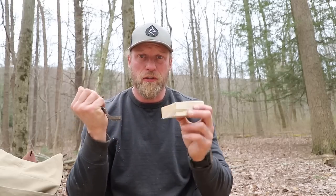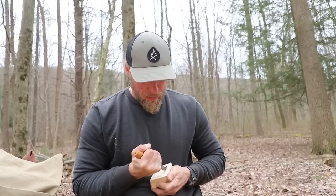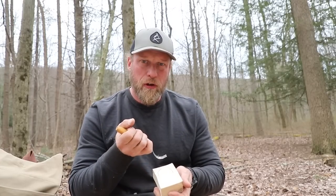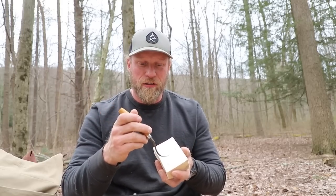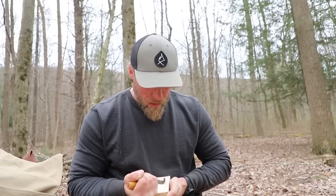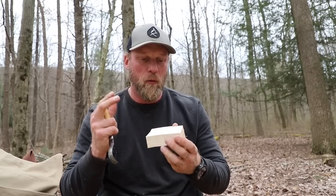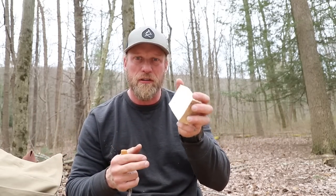For the carving process I'm going to be using a hook knife. I can tell you from teaching carving with these hook knives, this knife causes so many cuts and injuries - it is unbelievable. You need to be extremely careful when using a hook knife. With the hook knife you're generally going to be cutting across the grain and cutting towards yourself. If you start to run with the grain, the blade - just like a baton - is going to run with the grain. And if the grain runs outside of your project, you're going to cut the wrong piece. So just take your time and start to work on this. It's going to take a little while, but I'm going to work on this, enjoy the great outdoors, and show you where we're at once I have some progress.